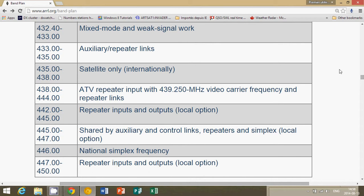Here in Montreal, 420 to 430 has a lot of commercial use and trunking — lots of commercial companies use those frequencies. Starting at 430, from 430 to 440, I will usually hear amateur radio satellite downlinks in that frequency range. And 440 to 450 will be the main FM mode repeaters.